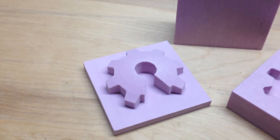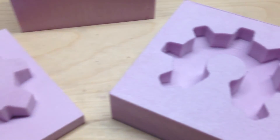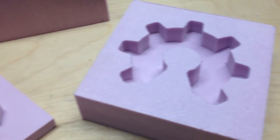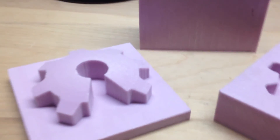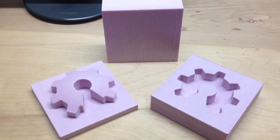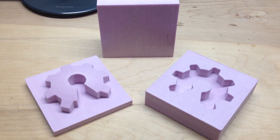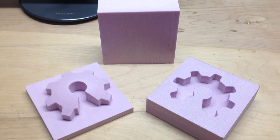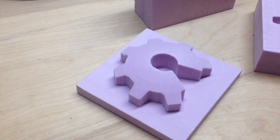Here's the quick models we ended up with. I have both the positive and negative of the same gear. That's actually the open hardware gear that I just brought into CAD and put some curves on it and some other stuff to kind of showcase what the machine is capable of. These took about maybe 20 minutes, half an hour each, but I was only milling them at 100 inches per minute, so kind of slow. I could have gone up to about 500, but I was doing other stuff and I wanted a kind of nicer finish. So that is what we came up with.